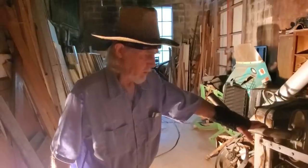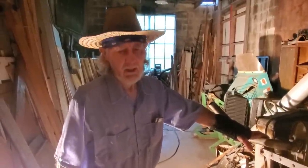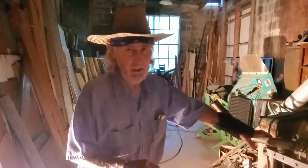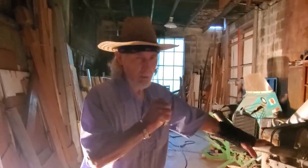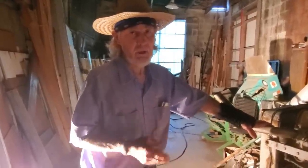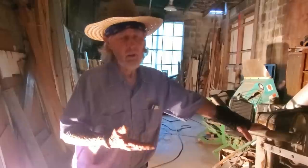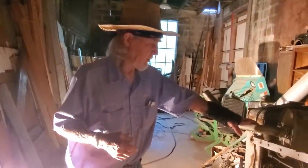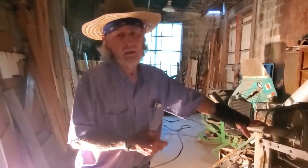Okay. Well, what we're going to do is pull the plugs out. But before we pull them completely out, we need to get a chunk of hose or something that we can blow through, because I don't have an air compressor back here. Once we loosen the plugs, we stick the hose down there and give it a good blow to get the dirt out so it doesn't fall in the cylinder and get caught between the valve and the valve seat or scratch the cylinder wall. Then we'll take the plugs out and put some solvent or WD-40 down in there, whatever I can find in the other shop. And we're going to need to get a starter. After we lubricate it, we'll turn it through by hand if we can, see if that helps any.